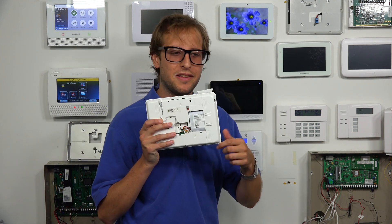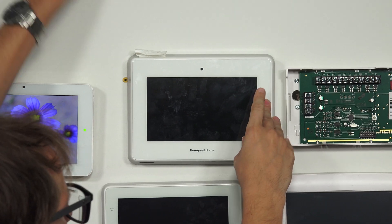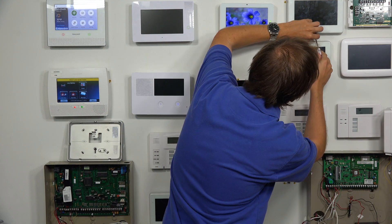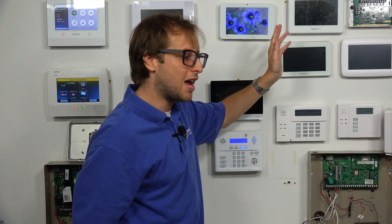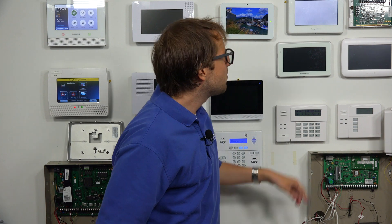We've got the slot cover fully back on the Pro A7 Plus. We can put it back on the backplate. The system won't receive AC power until we plug the transformer back in — we'll do that last. We're reapplying the set screw, which is a slightly larger set screw than the one used with the Pro Takeover module. Insert it carefully and screw it into place. If you have it on the backplate correctly, you should be able to get it all the way in. The panel is now remounted on the Pro Takeover backplate — not the original stock backplate. Use the one with the antenna, otherwise the Pro Takeover module will not have useful range. We're going to plug the transformer back in and the panel is now receiving AC power and going through the boot-up process.